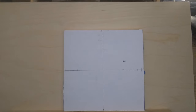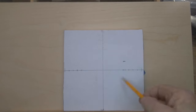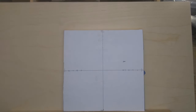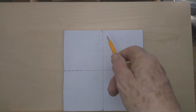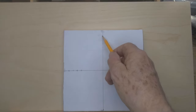Okay, I got the paper mounted. I've split that. This is actually a 7 1/2 inch blank. I'm going to make a 7 1/4 inch round blank out of it for the bowl. And I've got that mark at all 4 sides there. So that gives me a more accurate way of setting my compass, I believe. Once I get the compass set right in the center point there, then I can set it for these. That's the outer ring. Then I've got these four little dots.